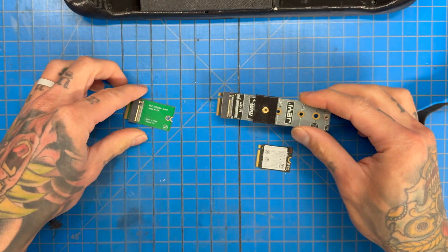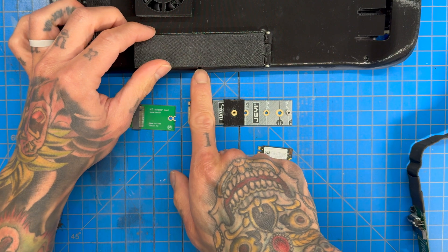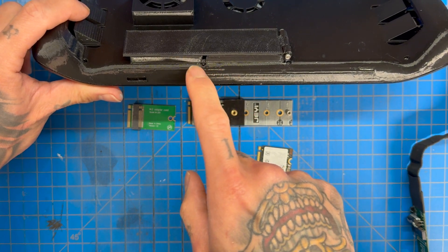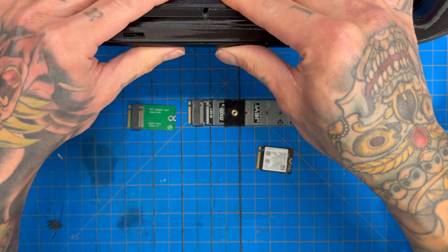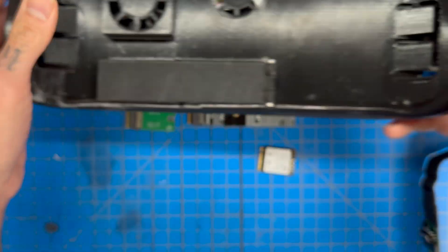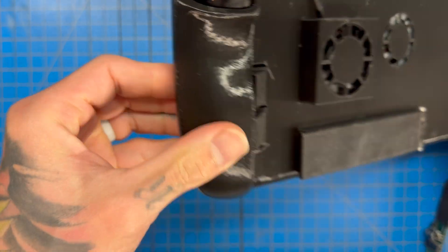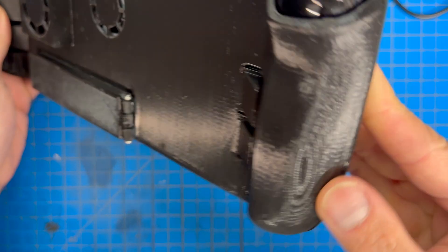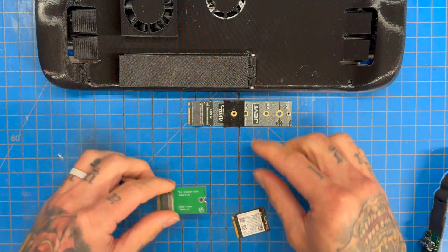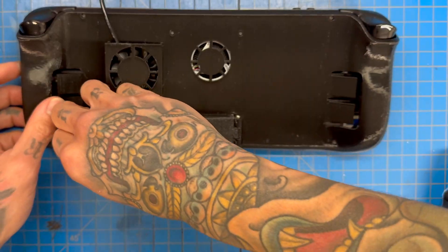Notice I had to do some shaving. On the next version I'll have to make this thing slightly wider, which is an issue because this screw is a bit of a problem. On the final version I've got to figure out what to do with the screw hole, because I'm not able to screw it down properly and we're getting a slight bump out. But for the most part, pretty good seam all the way around — it's serviceable. It's not as bad as the old ones, but by no means a perfect backplate — nowhere near something in the aftermarket. But remember, this backplate's main focus is function.